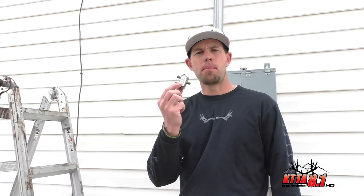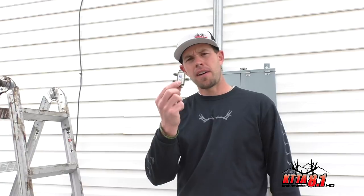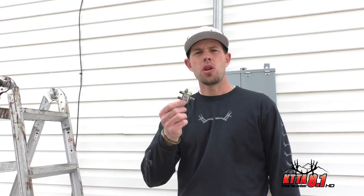What is important to know when you install these splitters is they're dividing the signal, and that can lead to the picture skipping and blocking, which is not very fun to watch. So make sure when you do install these splitters that you use a preamp booster to boost the signal before you go into the splitter, then come out of the splitter and go into your TV sets.